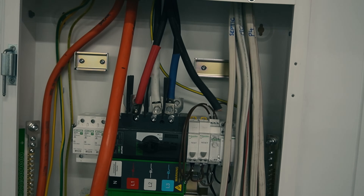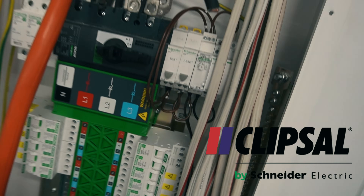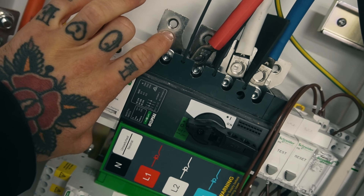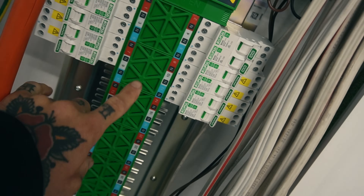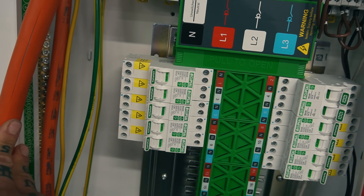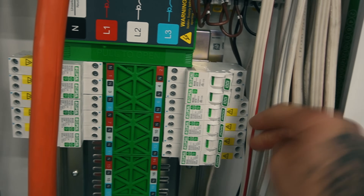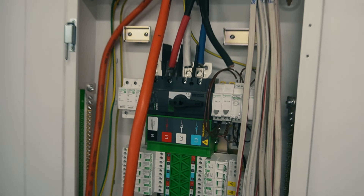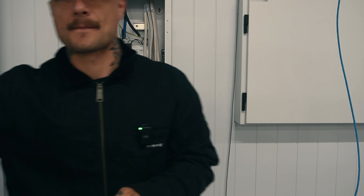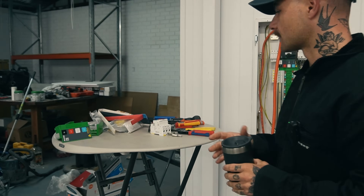Now, like I said, one of the first in Australia to install this. We've had it here for a while - there might be a few more getting done at the moment, but we have been waiting to get it installed. So what's the difference? Well, if you look here, there's a neutral terminal that feeds the chassis, so none of your RCBOs require a neutral tail out to the bar. So it's literally bring your feed in, wire neutral straight in - bang, bang, bang. The idea is it's going to be heaps quicker and a neater install. That's the main point really.